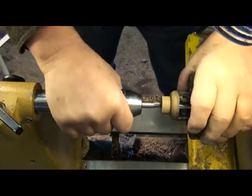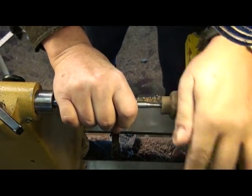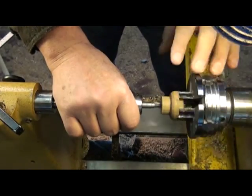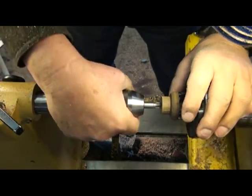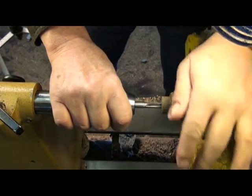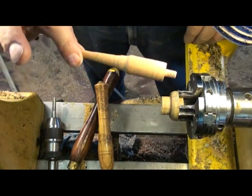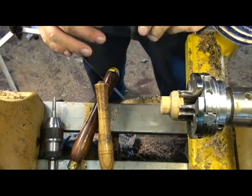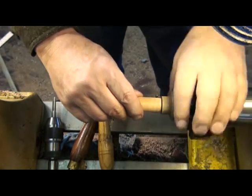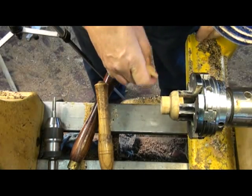I think I'm in pretty good shape here — it's going in there nicely. I'm going to come out one more time. This is lignum vitae and it threads really well whether you're doing it by hand or with a tap. So just to test my fit, I have a finial blank with male threads on the end and I'm going to test this. These threads are the same so that should fit on there. I just need to turn the rest of my nut and we'll be ready to go.